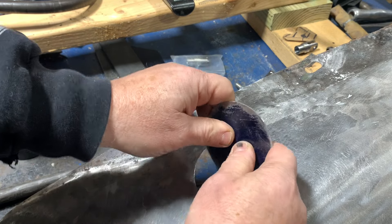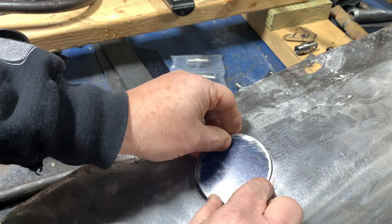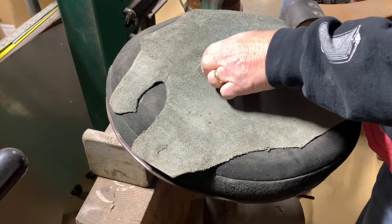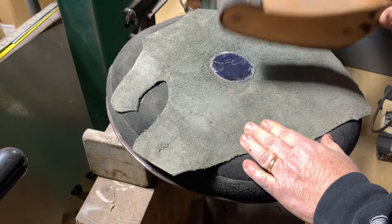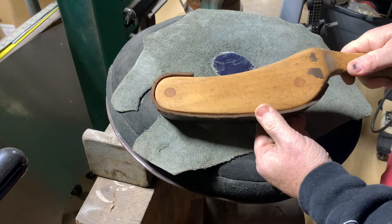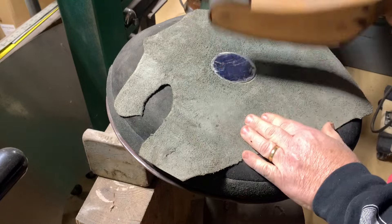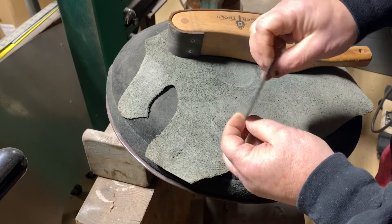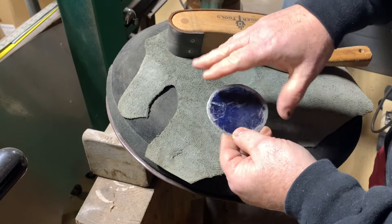Sometimes you can do it by bending it outward like this. See how much smaller that made it? It went right through the hole. It's really one of those things where you can't see it, but you can feel it. Now this is just like what an English wheel would do — this little mallet right here. I just went around the edges of it, let the center open, and gave it a dished-out area going two different directions. Almost made a very slight bowl to it.